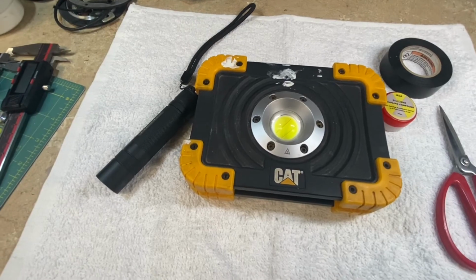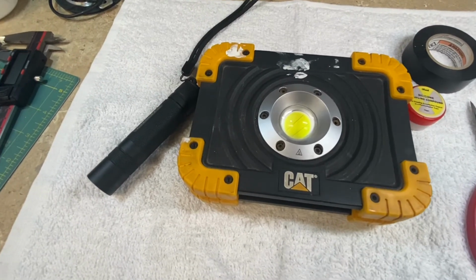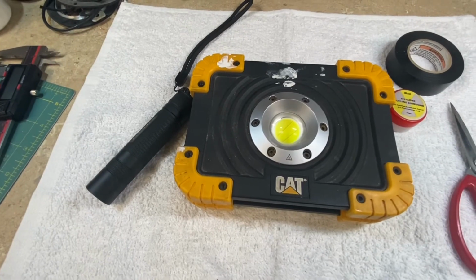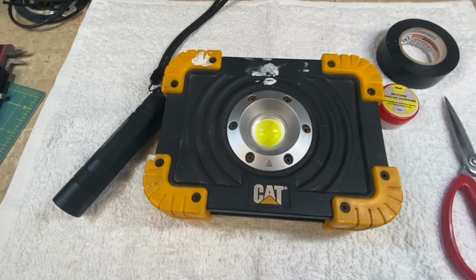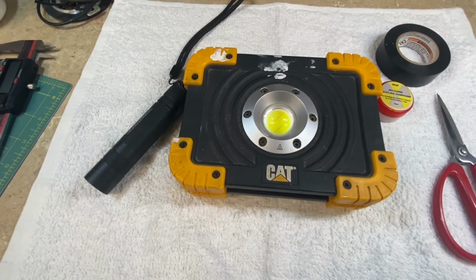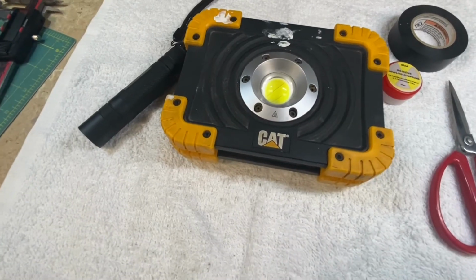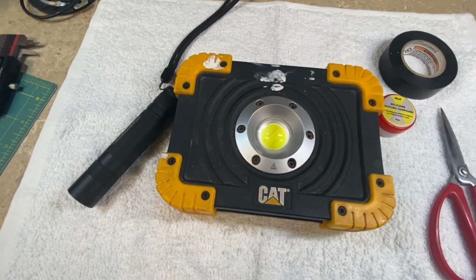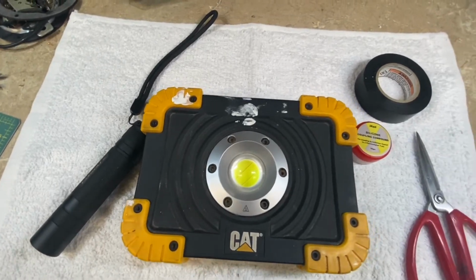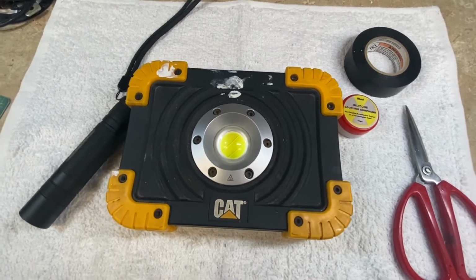And on the second time with the illuminated test, it fell completely to the bottom, right up against the crystal assembly, which gave it a much higher count. Just for the purposes of discussion, the unlighted, where it stopped about a quarter or a ½ inch above, provided 231 pulses per second and had a grand total after 500 seconds of 114,559 pulses. The secondary illumination test resulted in 172,935 total pulses with 346 pulses per second. So that was a pulse per second difference of 115 and a grand total difference of 58,396.